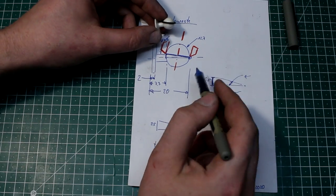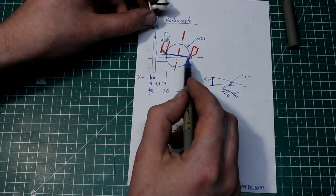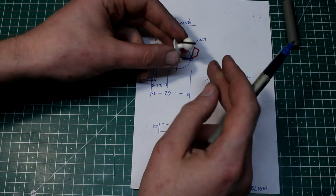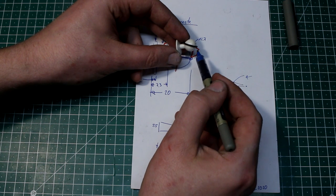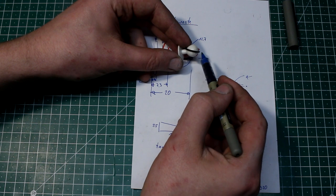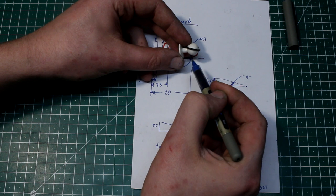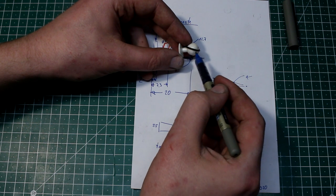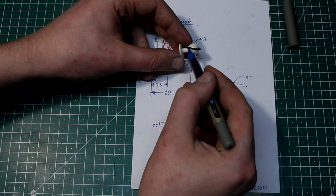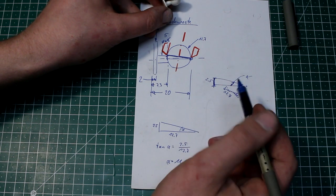Okay, while the parts are in the tumbler, we can talk about math, just for fun. We have to tilt the indexing head so the cutting tool can clear the shank of the ball. If you look at this button here, and the black ring, the O-ring around it, it's basically the path that the tool sweeps around the ball, and the ball is rotating at the same time and creates this hemispherical shape. And this angle at this path here is tilted. That's what we need to calculate.